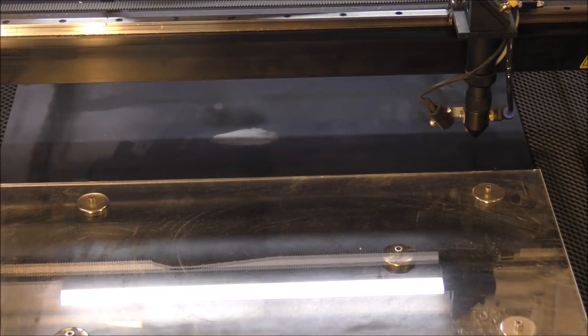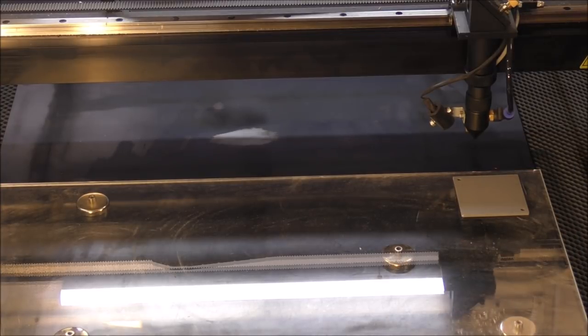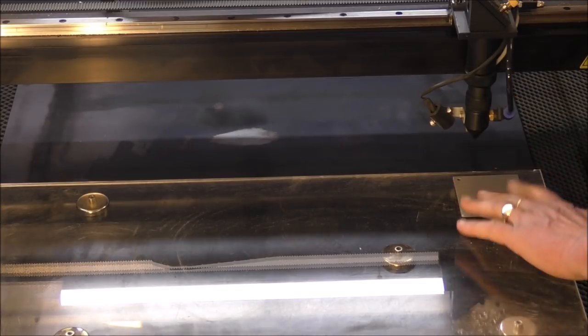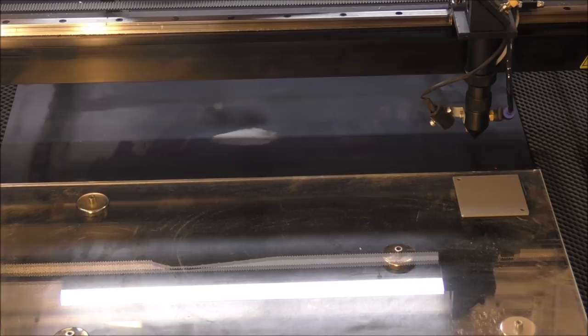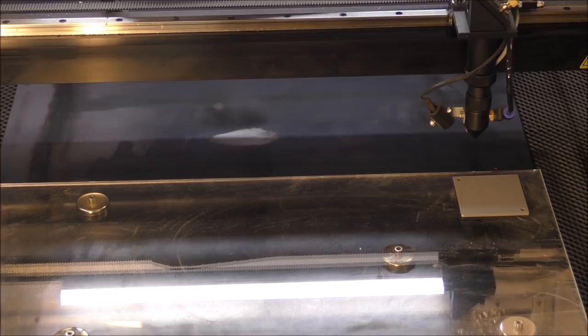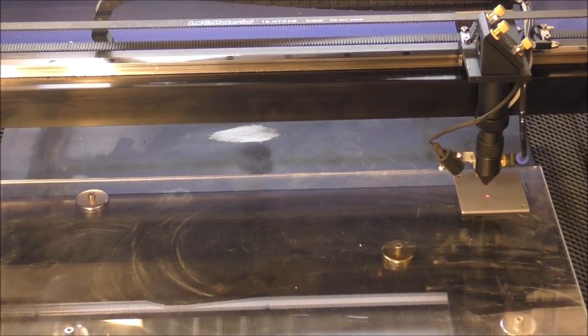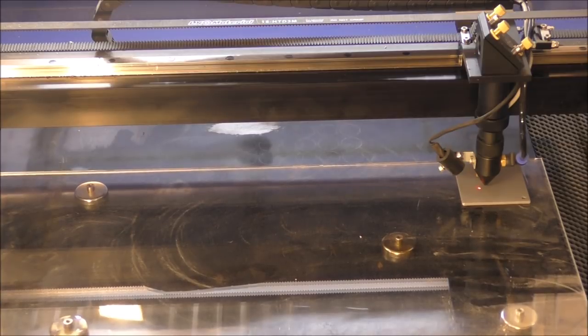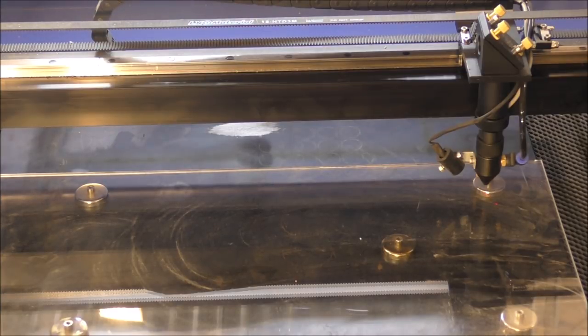Okay, now then, this laser comes with an automatic Z. So what we're going to do is maneuver the head now over this metal plate. It's got a rubberized paint on it, so it doesn't scratch anything. This on here is just dust. Okay, so come over the material and press Z datum. It will automatically come up, sense that plate, and then take it down to the correct depth. And we're going to now take the head just over to this corner.